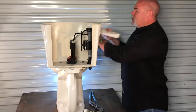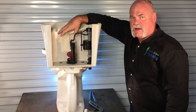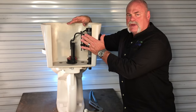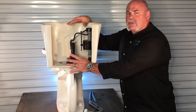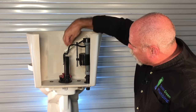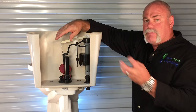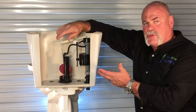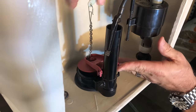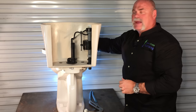When you're looking down in here from the top, you're going to see the flapper is attached to the flush valve. Now there are different kinds of flush valves. Make sure that you've looked on the inside of your tank to get the right part number, that way you get the right one. You always want to make sure that the top of your flush valve is below the vacuum breaker on your fill valve, because that keeps you from creating a cross connection where you can actually suck toilet water over into the drinking water. Once you're in here, you're going to reach up, take apart the flapper, pull it off. I normally go ahead and disconnect it from the handle to get it completely out of the way.